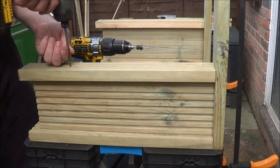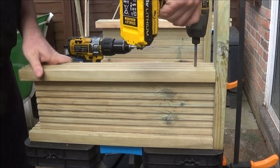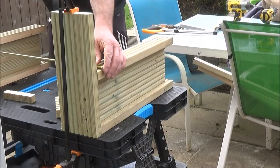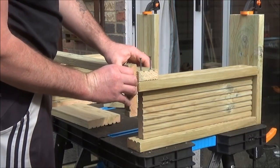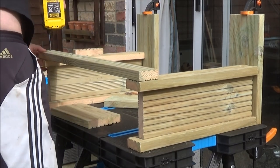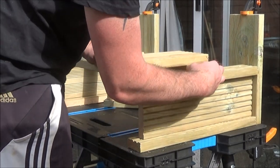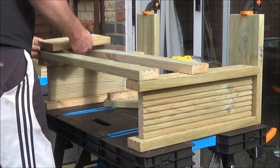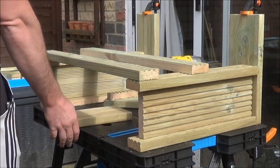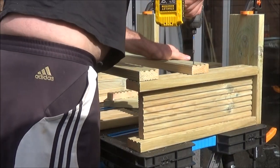The screws I'm using are actual decking screws for outside use. Another check to make sure I had the right spacing and everything was square, and then these are what I would call the stretcher parts — I pre-drilled some holes and simply screwed them into position. To make sure they were evenly spaced, I just placed a step piece on top and ensured they sat flush and level with the back and front of the step, then simply drilled and screwed. I don't want to use any glue on this project in case something should break or rot over time — it can then simply be unscrewed and replaced at any point.